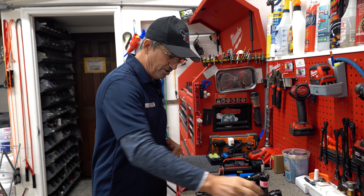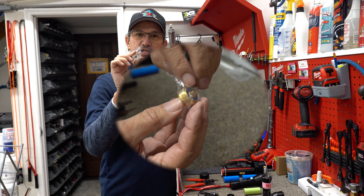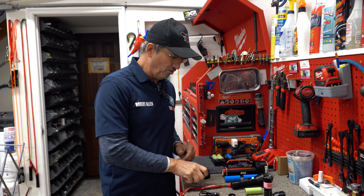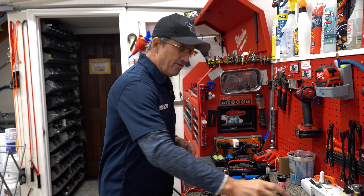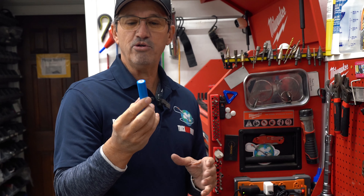When you just have that ring, it means moisture got to it and it's damaged. What do you have to do? You just replace the LED. We can send it out to you — you're going to need a set of ring pliers like this to be able to do it — or you can mail it to us and we'll do it for you.